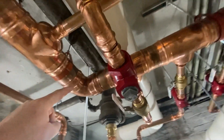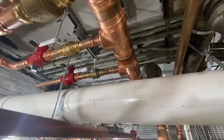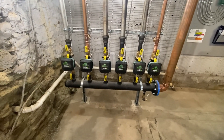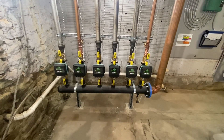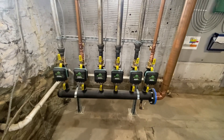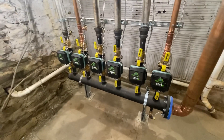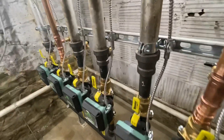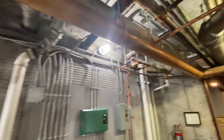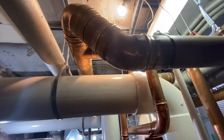Supply comes around here, elbows, and then we can pick up our other zones — six of them in total. On the return side we've got a manifold here. We put our pumps on the return; that's how they were with the old system, and we also didn't have a lot of room on the supply side to fit them. Honestly this is better for servicing — you can access the pumps nice and easy. We had a manifold welded up with threadolets so we could pick up each pump, with isolation valves and drain valves for each zone. The return comes up and then comes back across the room and then feeds back into our closely spaced tees.